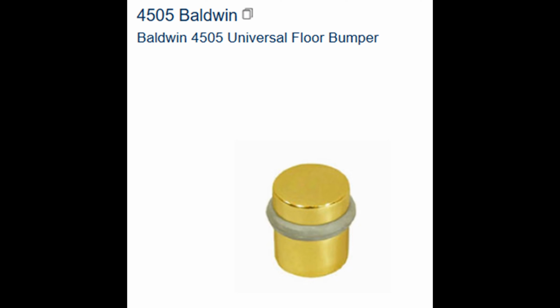I mean, exactly what you said. Buzz that thing down to the right length, and then that's either a number 12 or a number 14 flathead screw. Go find yourself a 12 by 5/8. That would be good, because you got the thickness of the base of the stop you're going through, and you're good. Okay. And if you find a 3/4, put a little washer underneath it, because the head of the screw is completely concealed, right? Yeah, that wouldn't matter. I just don't know how it adheres into the bottom of it, though. It may fasten. That's a bad idea. Don't do that. Get a shorter screw. Get the right length screw. Probably 5/8 would be my guess.